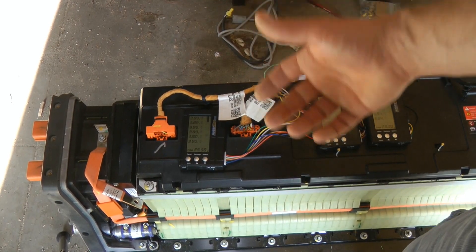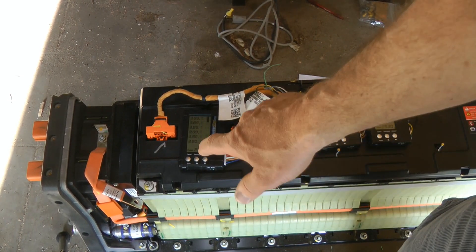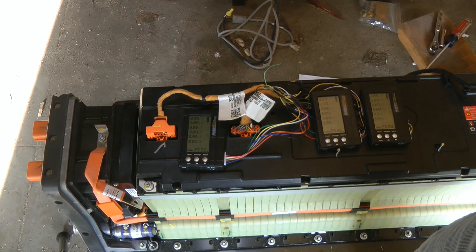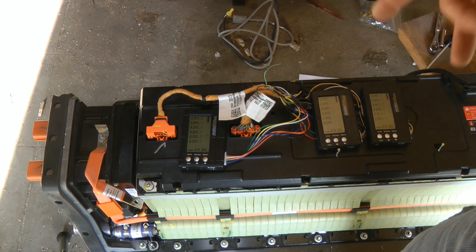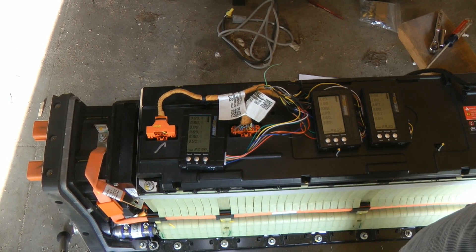I think I can technically balance the out-of-balance cells by using the discharge or balance feature. I don't want to try that right now until I have a way to charge this battery pack back up — the last thing I want is to discharge it and not be able to charge it again. So I'm going to wait until it's hooked up to my solar controller. This exercise was merely to set up a BMS and battery monitoring system — you can hook one of these up, except you'll need two for each large chunk, and there are five of those, so that's 10 to 12 of these things if you want them all mounted and visible at once.